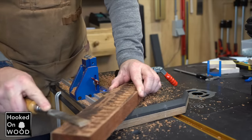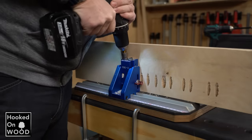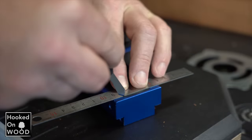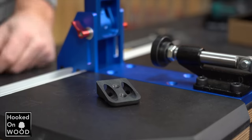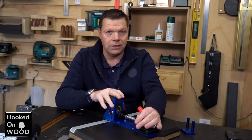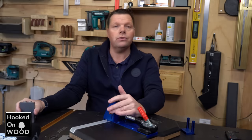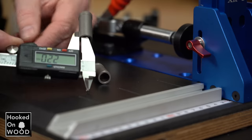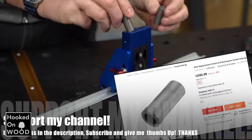I also made multiple holes in 25mm thick plywood and some oak. After using and abusing it for a while, I looked at the wear on the middle piece. Of course there is a little bit of deviation, but I think what we see here is pretty normal. What is nice is that you can replace this section when you want to, so the aluminum insert stays intact — something that is not the case with other models. The most crucial parts are the bushings, and this version has even thicker bushings than the already-good ones from episode 16, so I expect it to have a long lifespan. These bushings can also be ordered separately, which increases the lifespan even further.